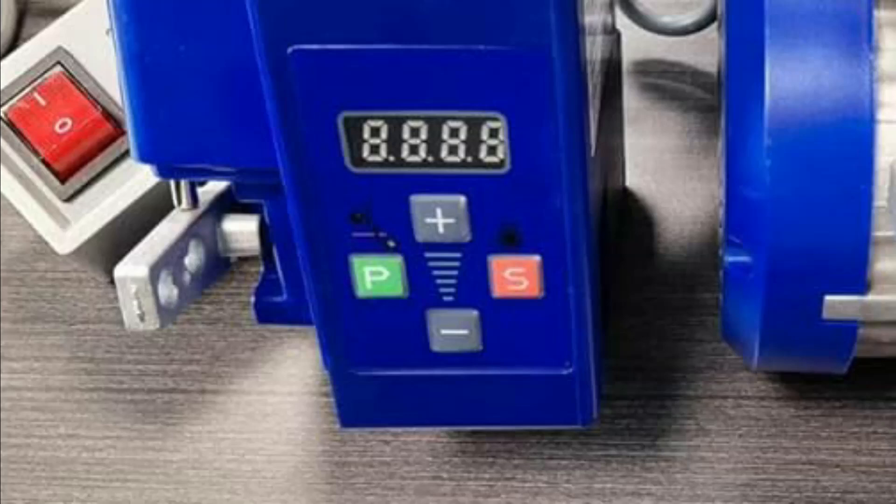If you need to watch the speed at which the motor is working, press the S and P keys simultaneously. Then you can see the C01 display. Press the P key, then press the pedal switch down. While the motor is running, you can see the speed of the motor rotation on the display according to current conditions. These C01 parameters can also be used to diagnose motor faults.